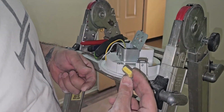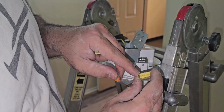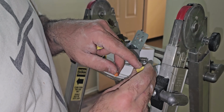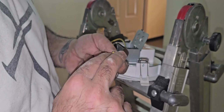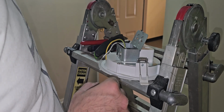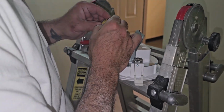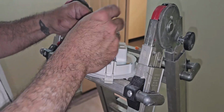All right. And then I'm gonna add these quick connects. These have 4 inputs. These only have 3. So one is gonna be for the light, one's gonna be powered out to the rest, one's gonna be power in from the source, and one is gonna be power circulating to the other side. So it's gonna have basically 3 outputs and a single input. So we're gonna put the black line in first. Another squeeze just for safe measure.